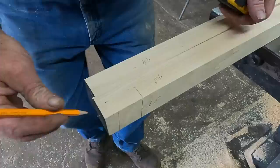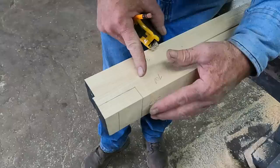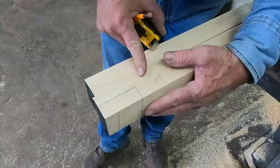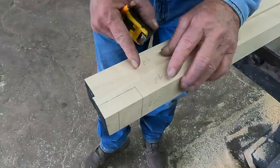I'm going to change the name of this coach to Change My Mind Coach instead of Mud Coach or Mud Wagon. I want these to be out flush with the edge of the bow, and then there's going to be some 3/8 slats that'll fit on top of the bows. On the side, it'll come out flush with the iron, and on the rest of the bow, as it goes up over top, these slats will sit on top, and that's what holds the canvas in place.